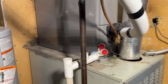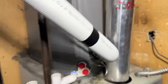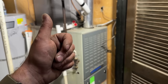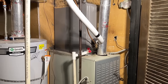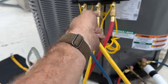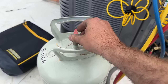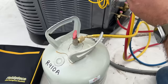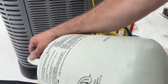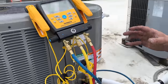Here's our finished product — we've got the TXV installed. This is definitely closer than I'd like, but I think we should be okay. Everything is installed — we're just waiting for the time delay to turn off, and then we'll go upstairs and check our pressures, make sure everything comes on like it should. We've got our tank here, we're going to go ahead and take our yellow hose and hook it up. We're going to open this up, go ahead and purge it — that's it. Now we flip it, put our disconnect in, and hopefully the furnace is on by now and everything will kick on.